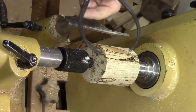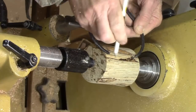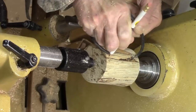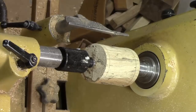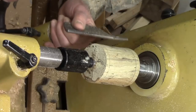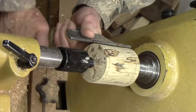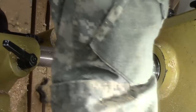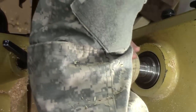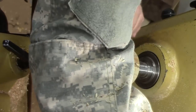I've got it measured for diameter, so now I'm going to evenly mark from here to here and here to here. Now I'm going to use my beading and parting tool to part that down. Let me adjust the tool rest a little bit closer — it's round, got a little bit of clearance. Going to drop this just a little bit. This is pretty punky since it's sending out a lot of stuff, so I'm going to turn on the dust collector.